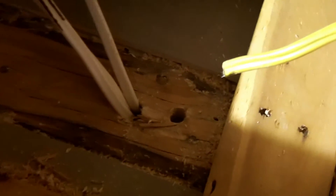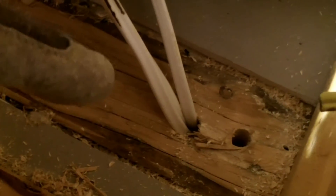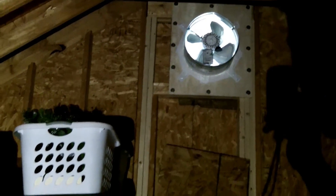I'm up in the attic. I've drilled a hole here — you can see where some of the other wires are going down into the wall — and just back here you can see that's where the light switch is. I drilled a second hole over here to the right, and I'm just going to feed my 12-3 wire down through the hole. Hopefully I'll wire up that switch, and then the balance of the wire can move over there to the attic fan. Hopefully I'll have this up and running in a little bit.